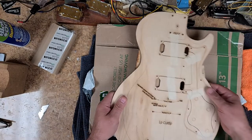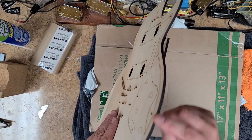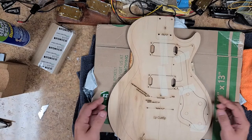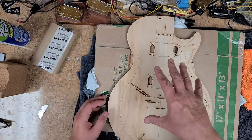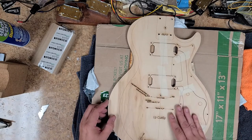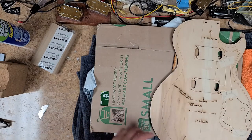So yeah, I picked this thing up. Guitars by Design, USA. This is burned around the edges. I can mount this to the top of the blank and outline what I want, cut it, hopefully on my bandsaw, and then use the template on the router so I have nice clean edges.